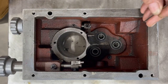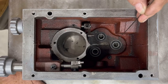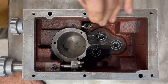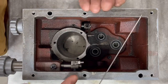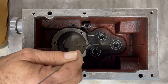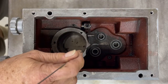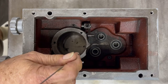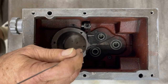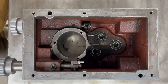Anytime a gearbox has bearings in a blind hole down in the bottom and a little bore like these are, the shaft's in here and it's running and it gets full of oil down in there. So bear in mind, as soon as you try and lift the cover off, if the shaft lifts up with the cover and comes up to the top, the oil will run down inside these guys, and then you can't get it back in because there's a hydraulic lock in there. You gotta really try and work it over time to get it down in there, so it can displace that fluid. If you try and hit it in with a hammer, press it in real fast, it's liable to just take that oil and push the shaft out again. In other words, it won't go in. You can't make it go in there.